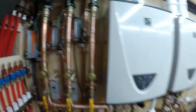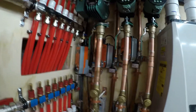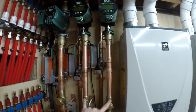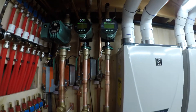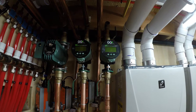As long as I have the snow melt switch on, this pump will be on all the time — it's the zone pump, so it will just circulate continuously. As it loses temperature the aquastat will sense that and come back on. It's basically a hands-off type system, all adjustable based on the aquastat temperature setting. Same thing for the radiant — as long as it's winter and I have the radiant switch on, which I'll pretty much leave on all winter, these will be running.